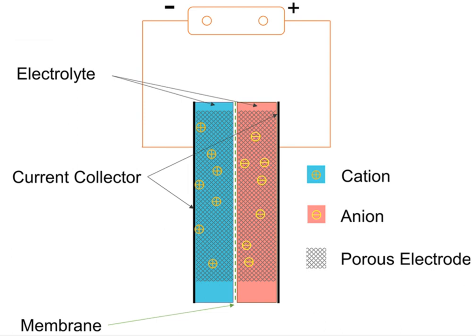This is attributed to the accessibility of the nanotubes' tangled mat structure, which allows a uniform coating of pseudocapacitive materials and three-dimensional charge distribution. The process to anchor pseudocapacitive materials usually uses a hydrothermal process. However, a recent researcher, Lee et al., from the University of Delaware found a facile and scalable approach to precipitate MnO2 on a SWNT film to make an organic electrolyte-based supercapacitor.